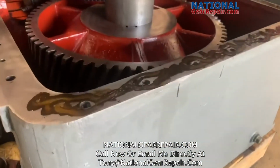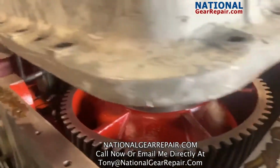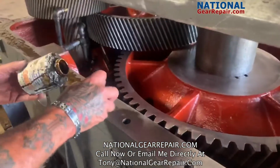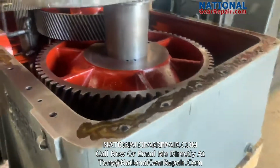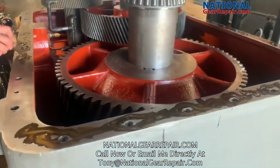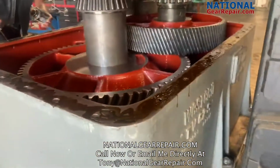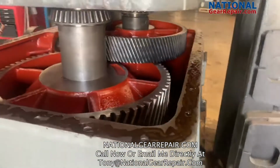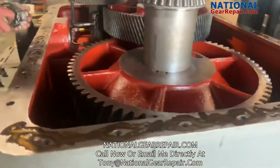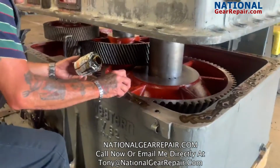We are now sealing our Western TV62 gearbox here. We are using a high-performance aviation sealant. This compresses down to about, I believe, about 2,000, so this box should be much quieter once fully assembled versus your normal Permatex. Again, we're using this as an aviation sealant, and this will seal much better for this application.